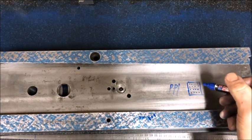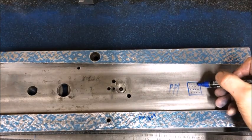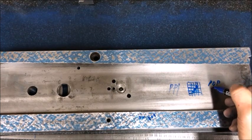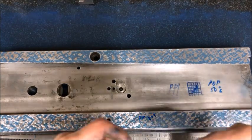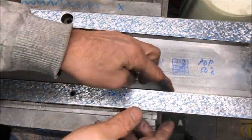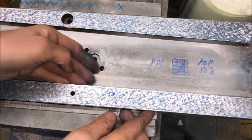In this case 16 points per square inch — normally 10 to 20 is okay for this kind of piece — and they should also be between 40 and 60 percent of the area. So if we draw up equal frames, the point should be as big as the hollow oil spots or hollow cavities, meaning we have about 50 percent point coverage. When we have a scraped surface after doing this, there will be much blue left, because we are not trying to eliminate all the blue spots — we are trying to cut them into two or more, which represents a real change from rough scraping.